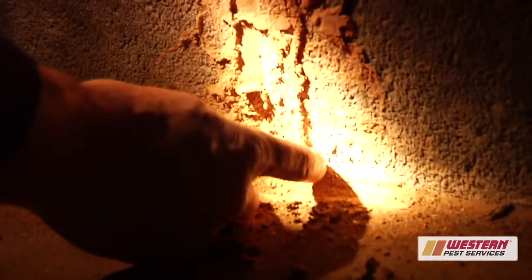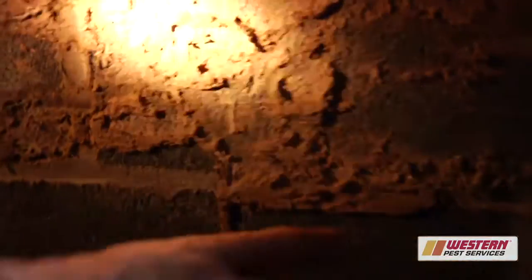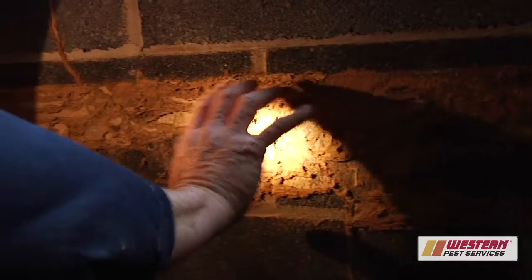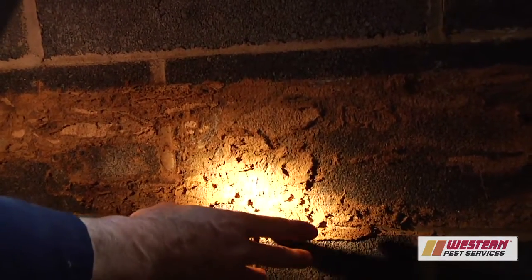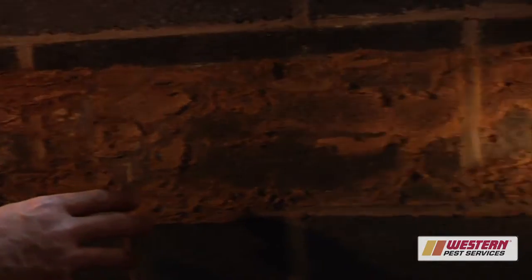We had the same thing that we had in the garage, where we have a tube that they built up from the slab coming up the wall. In this case, this room was covered with wall covering — either sheetrock or paneling — with furring strips on the wall. So what happened was they made it up far enough where they actually contacted a food source, and now they're hooked into it and they're not going to give up until they're done.